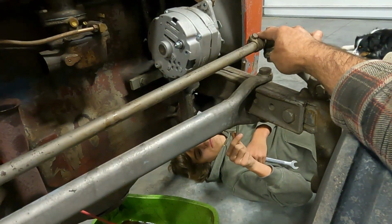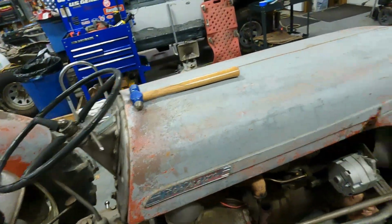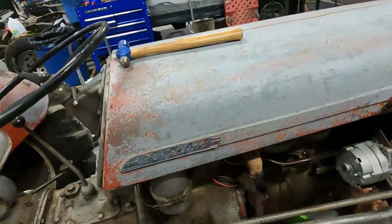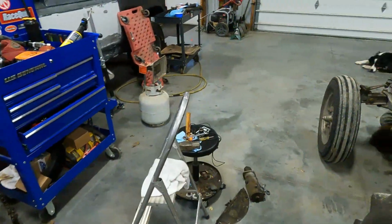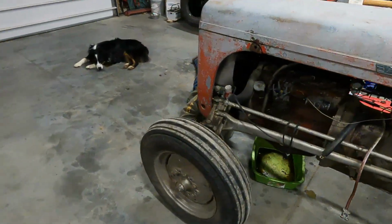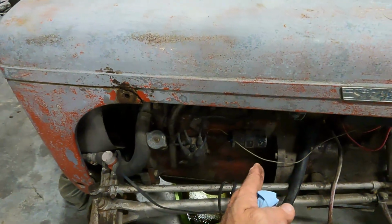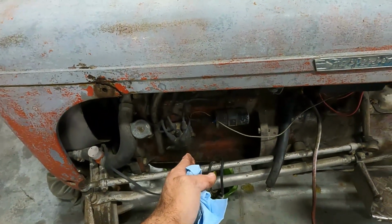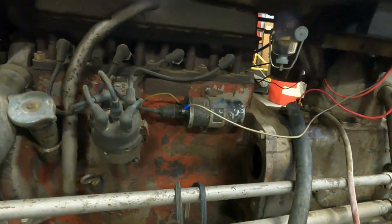We'll take the steering mechanism off here, we'll take this locator arm off here. Jalen's working on the hood like I said. We got just a couple wires and a couple other small things, and then we will literally jack up underneath this engine, loosen these bolts around what you would call the bell housing area.